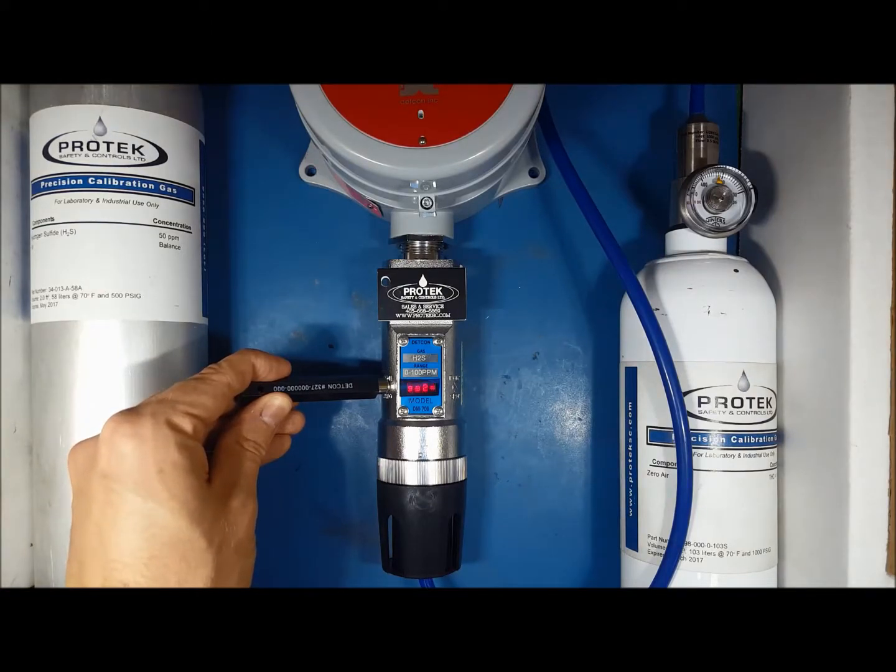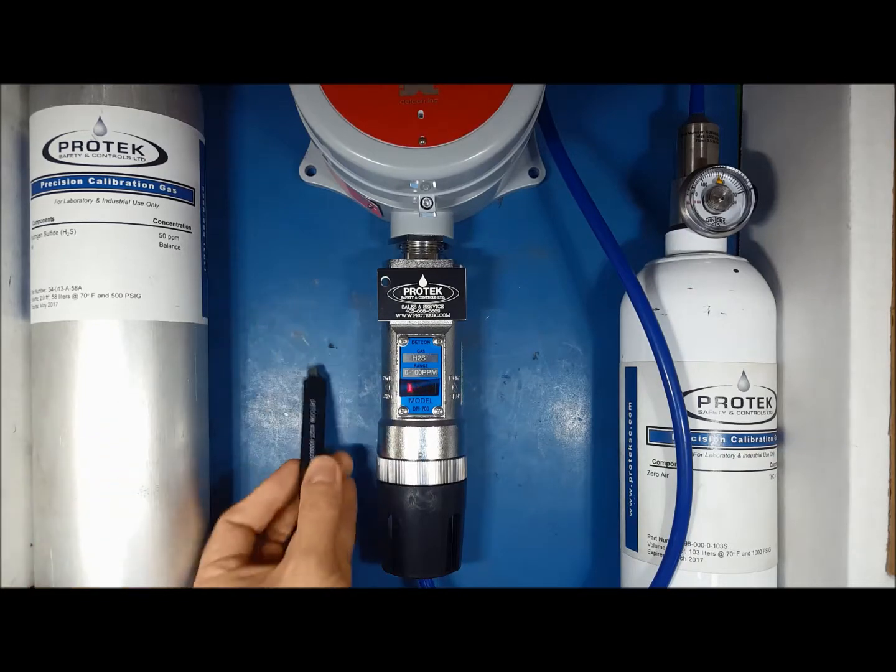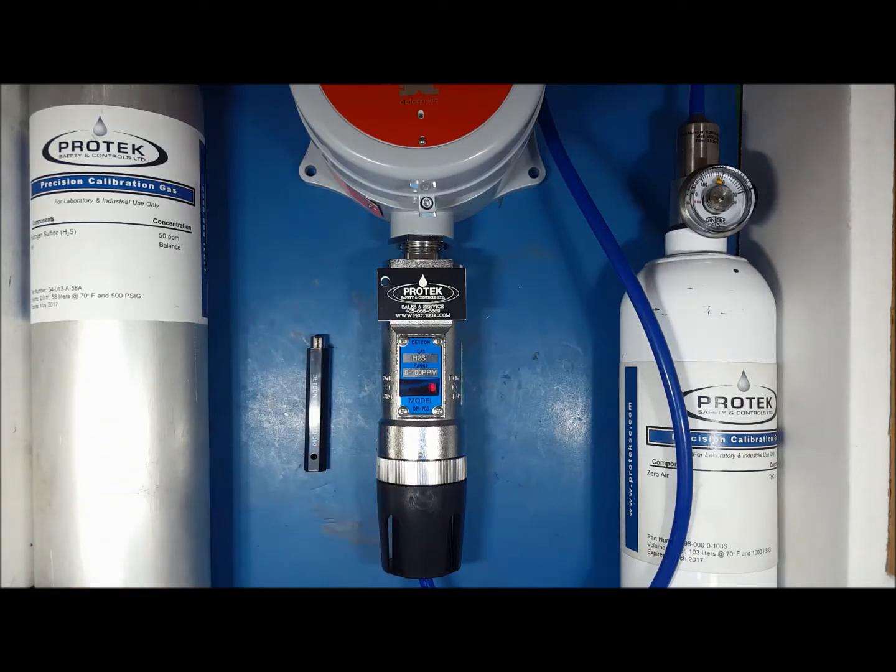The display will state 0 cal twice across the screen. At this point, the magnet can be removed from the transmitter. It will then scroll setting 0 twice. Once it is finished, it will finally state 0 saved across the screen twice. After this, the unit will go back into operational mode.